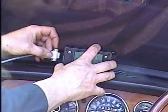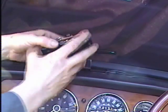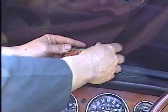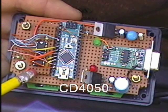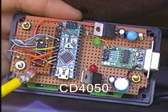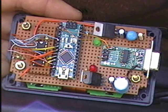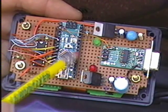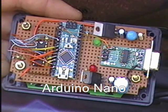If we look inside at my handiwork, the LCD panel normally comes with this small converter IC. Its job is to change the 5 volt signals from the Arduino board here into the 3 volt signals required by the LCD.